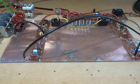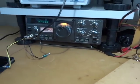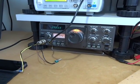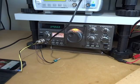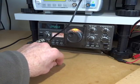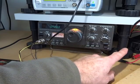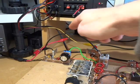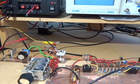So in terms of testing it, once I'd set the starting values for the BFO and VFO, I just used a simple podcast playing into the test transmitter on a really low power setting, so transmitting next to nothing into a dummy load, and then just having a short fly lead running across. That little yellow wire there is just sitting on top of the dummy load into the antenna input.